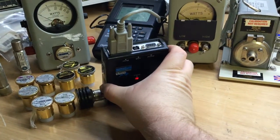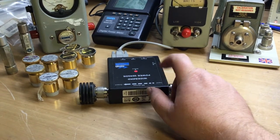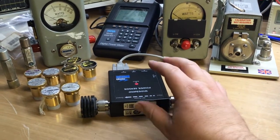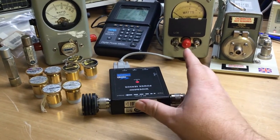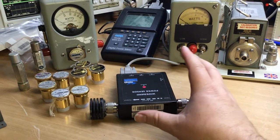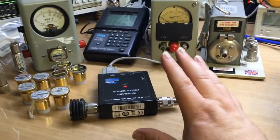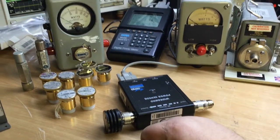Bird moved on to this type of sensor head, which has USB and RS232 ports on the top. Being a wideband power sensor, it can measure up to 500 watts RF power up to 1 GHz in this particular sensor model. It also opened up measurement capability into a different arena — pulsed transmitters such as radar, and digital radio standards such as TETRA, DMR, Fusion, D-STAR, and other pulse modes like TETRA TDMA and any kind of digital radio transmission using a pulsed carrier.